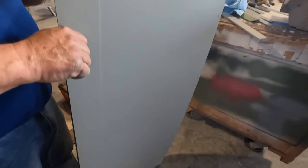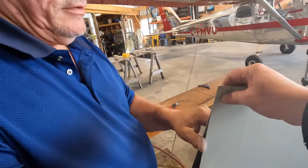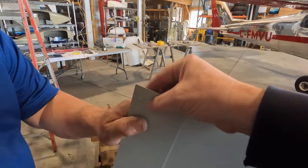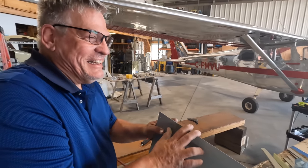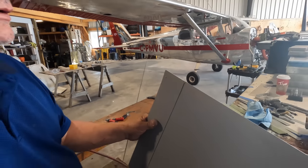The wing extension arrives, and you build it in a jig, right? Yeah. So it's built in a jig, and there's this rivet here on the trailing edge. That's what it comes for. That holds it all together, makes sure that it's in the jig correctly. It ships with this rivet in order to hold it all together during shipping. But before you start to do the install, you have to remove this rivet, or it's wise to remove it. You should remove it, because it's very hard to fit after. So the rivet holds it together in a way that you can't really move it around and finesse it into place. So you remove this rivet, and that's where Andre's going to start right now.